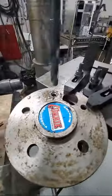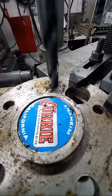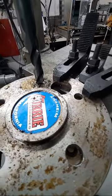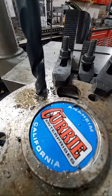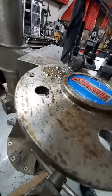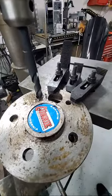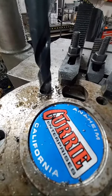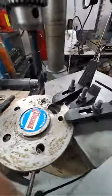That sounded terrible. It wasn't cutting like butter like the other cuts — either I wasn't going the right speed, or it just wasn't lubricating enough. I can see a little bit of deflection; it is moving a little bit. You probably can't see it on the camera, but it's like moving — that tells me this probably shifted. You can see it come in and then move over to the side. You don't want that. So I'm going to go in and loosen these clamps up a little bit.